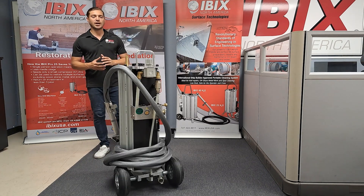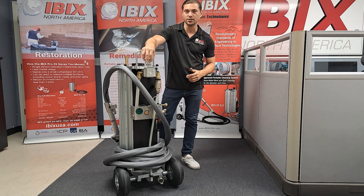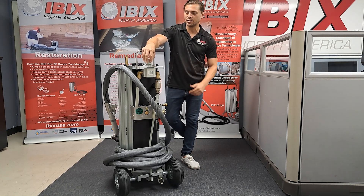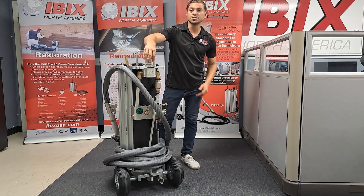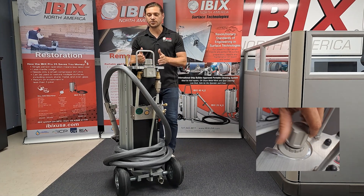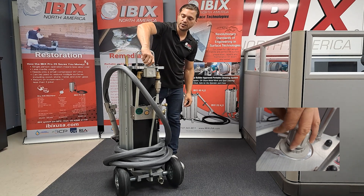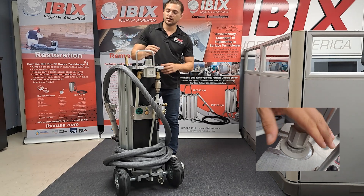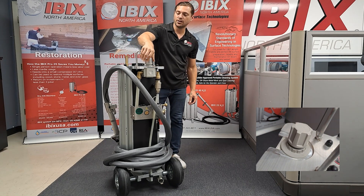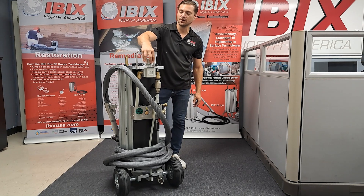The first main feature on the Hi-Pro 60 is the pressure regulator, located towards the back upper part of the machine. By turning this counterclockwise we can decrease the pressure to 3 PSI, or clockwise to increase it to 120 PSI. There's also a locking feature — if you have multiple users, push down on that cap and once you hear the click it will lock your setting. To adjust freely again, gently pull up on the cap and you'll be able to readjust your pressures: counterclockwise to decrease, clockwise to increase.